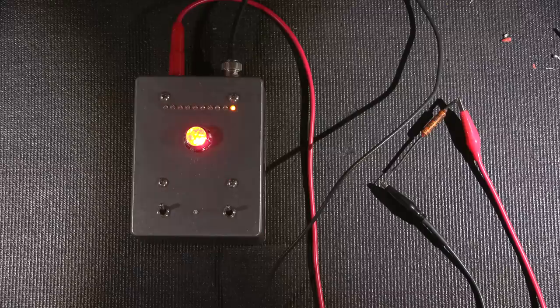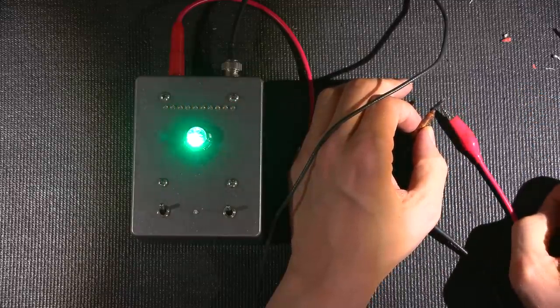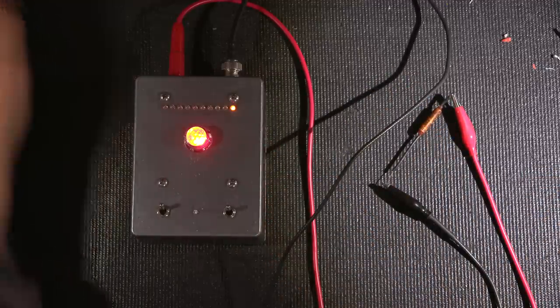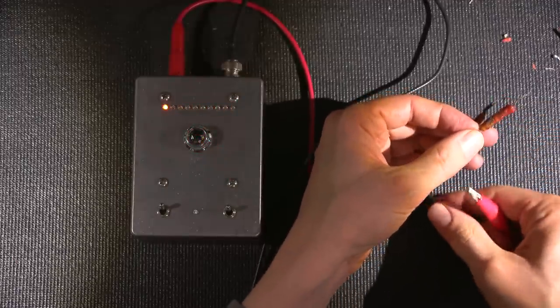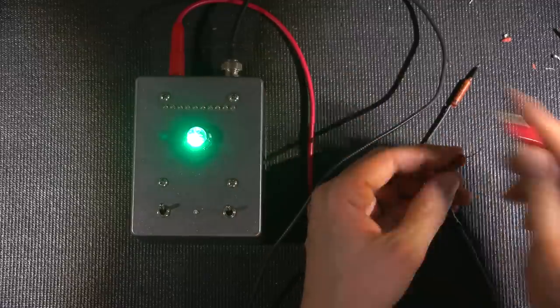As you can see, that is very leaky. Very, very leaky. So I'll open one end here. Okay. Clip that back on. And as you can see, this is indicating an extremely leaky capacitor. Now the 0.001 that I pulled out of there is leaky as well, but surprisingly, it actually let it count down on the scale. Usually these are so incredibly leaky that it won't even move.